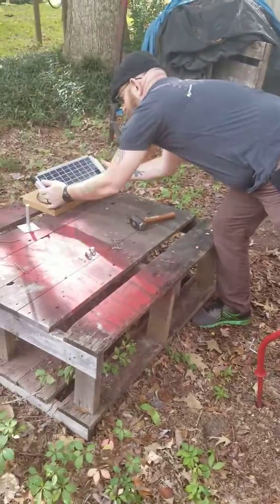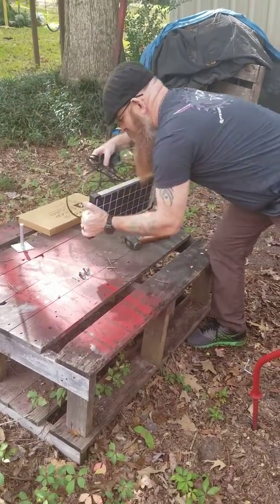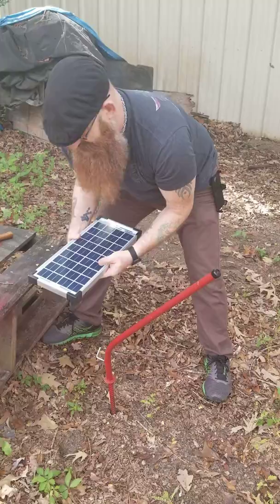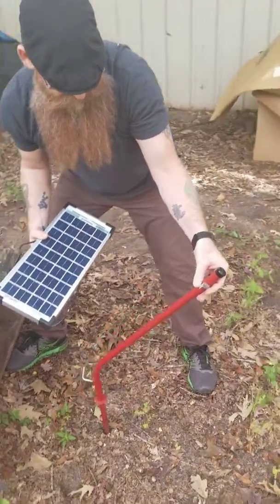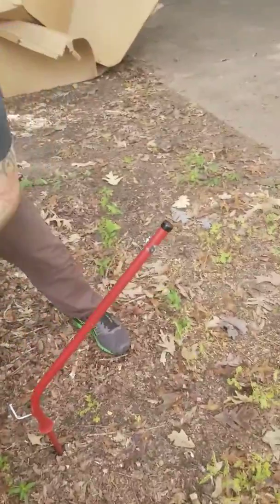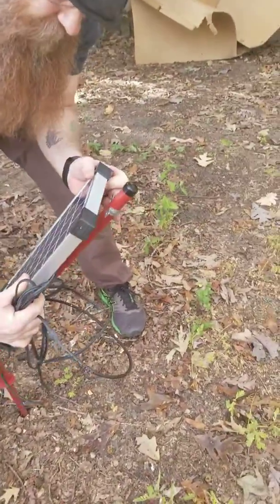We're going to put our black cap on the other end, keep it from filling up with water. Now this is one of our solar panel assemblies, but this will work with just about any kind of solar panel. The 3/4 inch clips are going to go around your mount assembly, and you're going to use the self-tapping screws to mount them to the surface